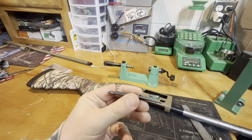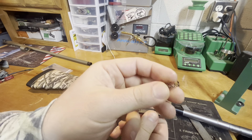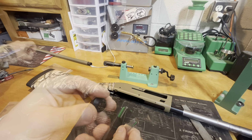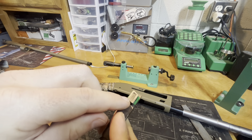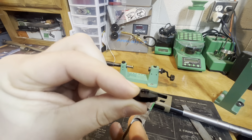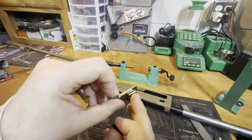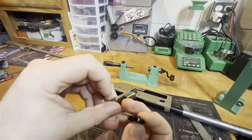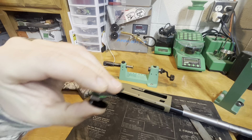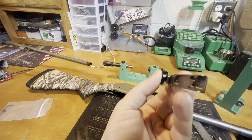Compared to the Silver, there's fewer moving parts and not an additional pivot pin. You can see this one has the same urethane washer and same type of spring that sits on this post. There's a groove milled in here, kind of like a picture frame, and then you have this stud. It's tapered and needs to offset — when you push this button in it's really close to the receiver, so a regular flat button wouldn't even open the latch.